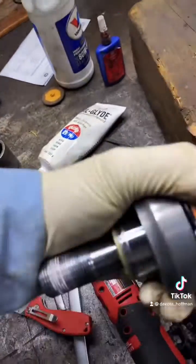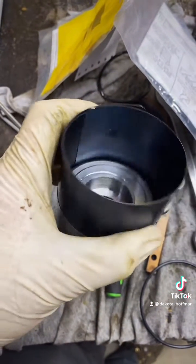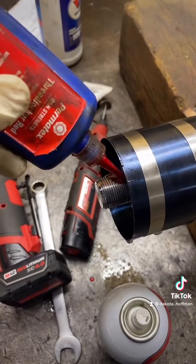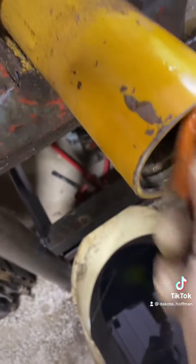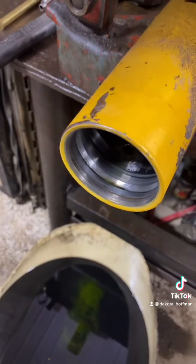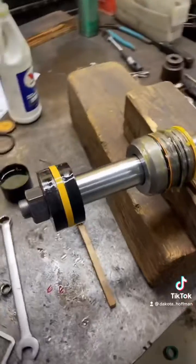Use the ring compressor to relax the piston seal. A little dab will do you. Pull your filler ring out, make sure the end of the tube is nice and clean — you don't want to get hung up or tear any seals going in. Once you've got everything all lubed up you can install your rod assembly back into your tube.